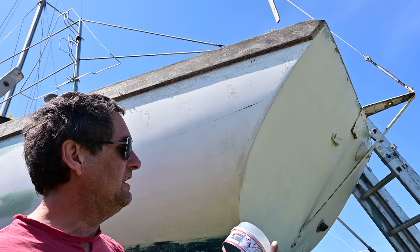This is marine filler, 2-pack filler. It's just like car body filler, but it's marine stuff. So yeah, that's the plan. Just fill. There's very few of these, not many. Just fill them with some putty. And then probably still skim them with this 2-pack filler, but all these parts skim with 2-pack filler and prime it, and then sand it, then prime it, and then it's ready to paint. So I look forward to that now. Let's do this.